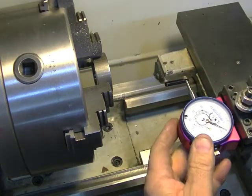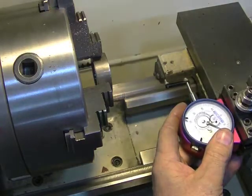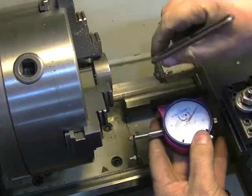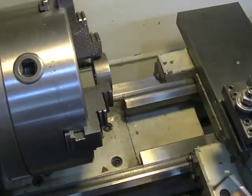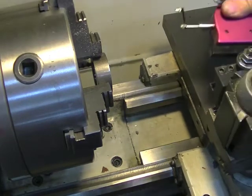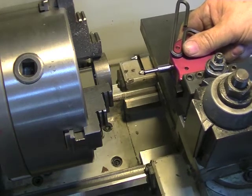The other thing is I want to take and face this way. I put stuff in there and I have to bump it flat sometimes — sometimes I have to take a thou or two or three thousandths off of it. And there's no way to do that with this. I have to get out another dial indicator or something, because if you put this in like so, you're upside down and backwards and you have to use a mirror or something to read it. That's kind of ridiculous.